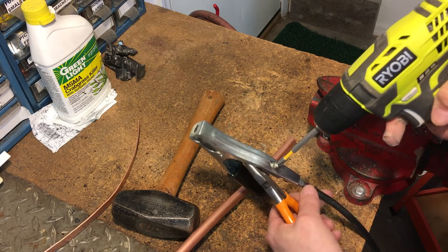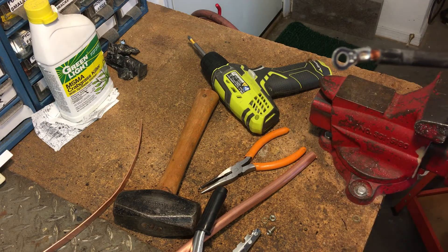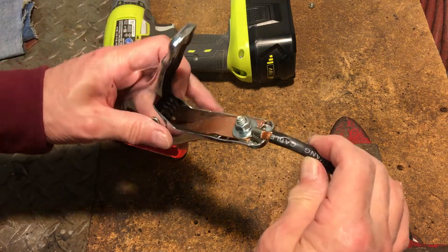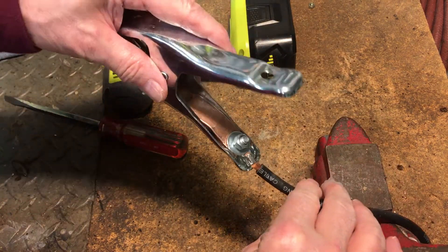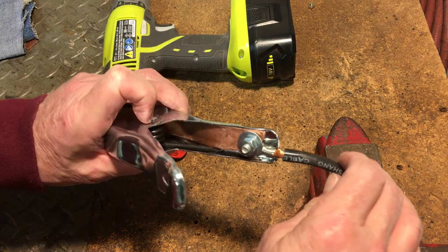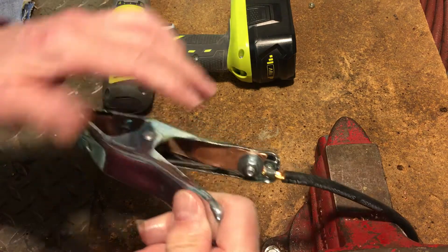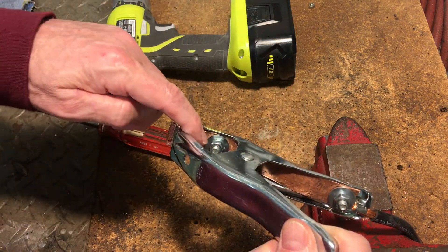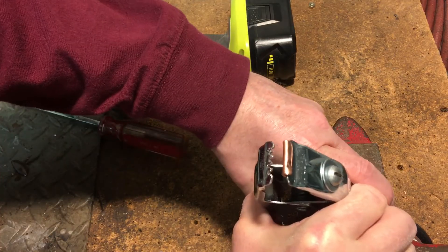Disassemble the old clamp from the ground wire to keep the mounting lug intact. Fit another 1/4 inch bolt or screw through the back hole. Use a big washer, a lock washer and a nut to clamp it all together. Use pliers to bend the teeth you cut inward so they will grip the metal better. You now have a solid copper connection on a really strong clamp for a couple of dollars. Thanks for watching my video and please subscribe.